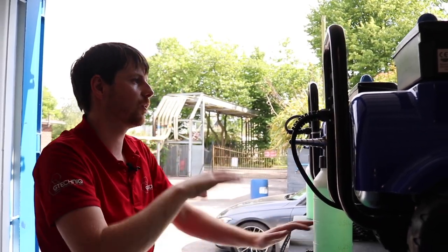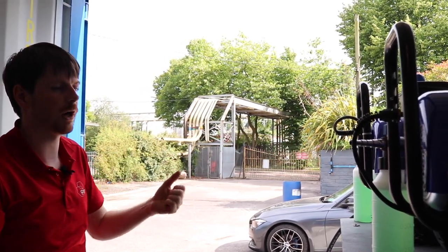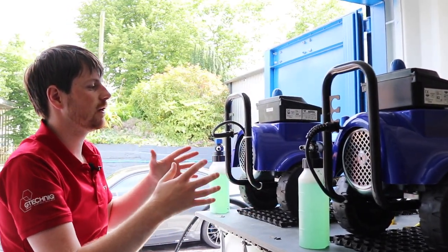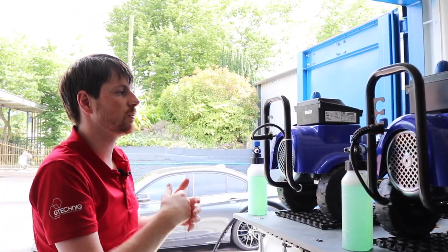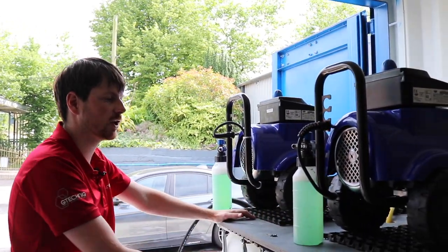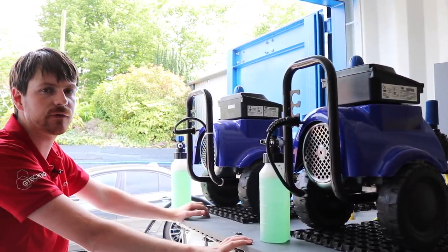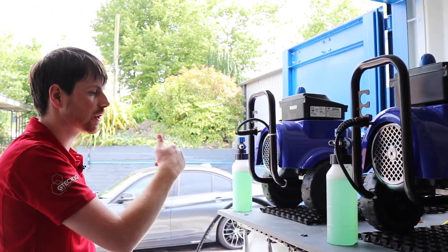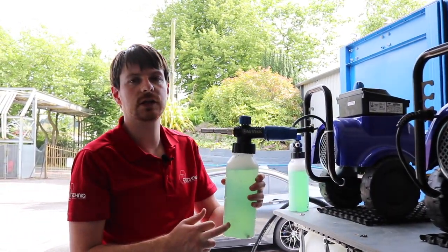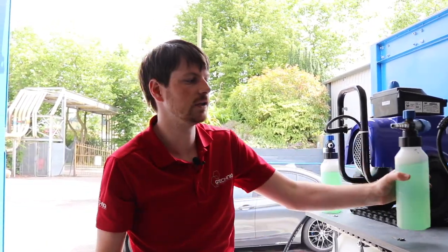Long term we're going to come through the side of the container, mount them properly, and put quick releases in both wash bays - quick release in and out on the 15-metre hoses. So that's what it looks like to set up a medium to large size car wash. We've got two power washers ready to go with a 1000-litre supply, both moving 11 litres a minute each at 150 bar each. We've also set up a quick release system so they can swap between the Nilfisk snow foam lance and the rinse lance.